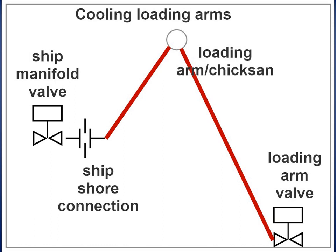To avoid the formation of vapor locks in the pipelines when cargo is introduced: if LNG is introduced into a warm pipeline, the initial cargo will vaporize, creating a large pressure that can block the loading of the liquid. It is then possible that this vapor will condense very rapidly as the temperature reduces below the condensation point, allowing the liquid to surge along the pipeline, possibly resulting in damage to the pipelines, valves, or connections.